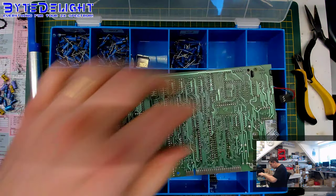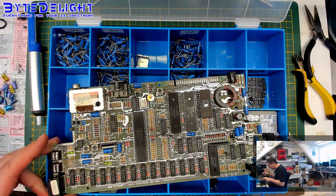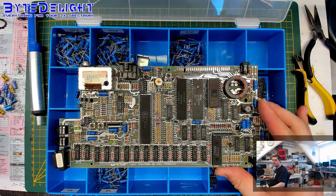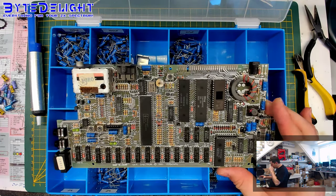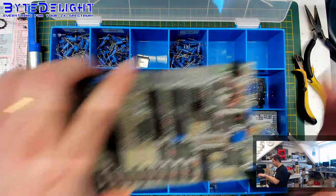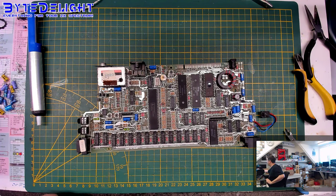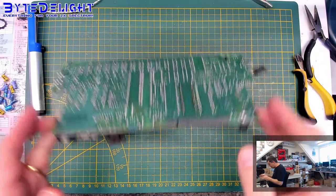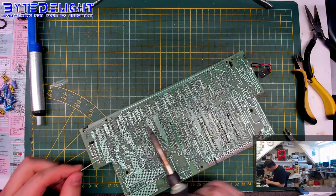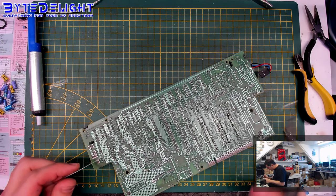Okay. So I think we got all the capacitors on. We can remove the capacitor container here. Let me check if I've got all the capacitors now. I think so. Just double checking. Yep. Okay. So as I said, I will check all the soldering joints on the bottom of the board because they didn't look quite nice when you just do the top of the board first.